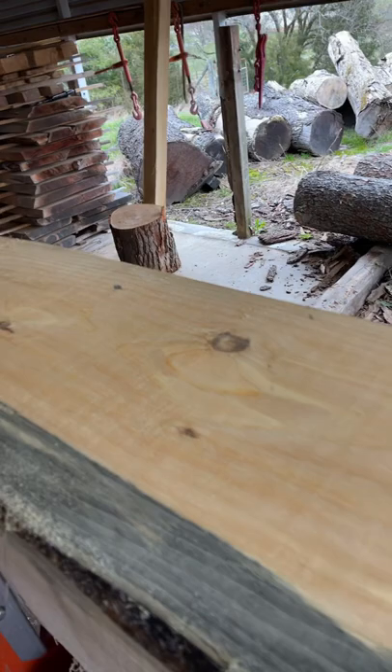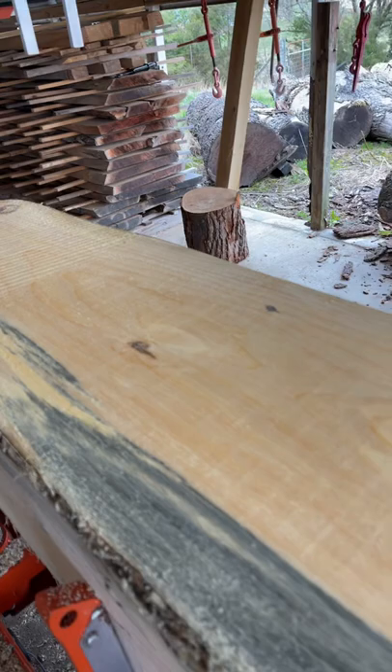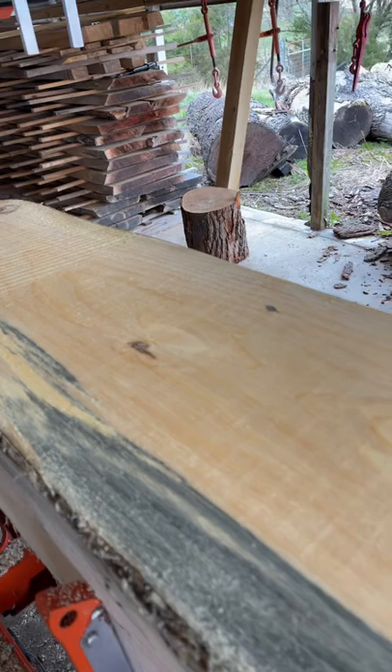So it's all about speed. Most of the time when you're saw milling and you see those washboard effects on your boards, it's because you're going too slow. Right here I was going fast enough — I probably could've gone a little bit faster. Down here I slowed down way too slow on purpose to show what happens when you don't go fast enough. I hope that helps.